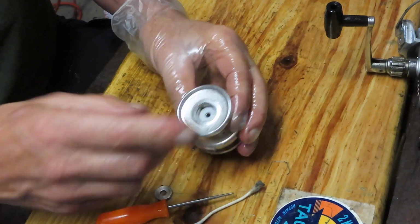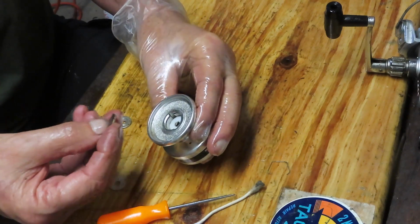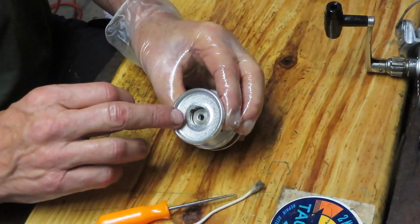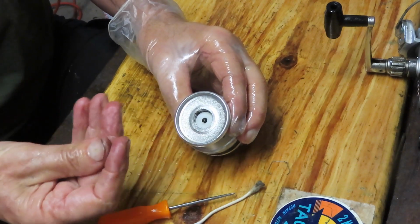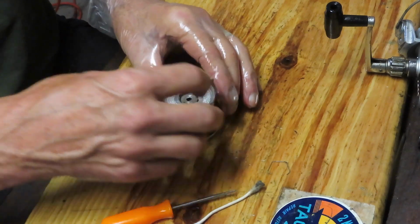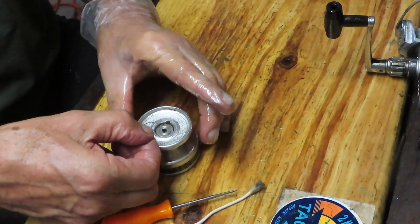Now it's a plastic washer. You don't service the plastic washers. They're self-lubricating. If you want to put a drop of oil in, that's fine. It won't absorb. Then we put that winged washer in. It's called an eared washer. It goes in both slots. Put another one of those in. I'm just wiping off the dirt on this as I put that in. It's self-contained and there's no issues with it other than some tarnish.